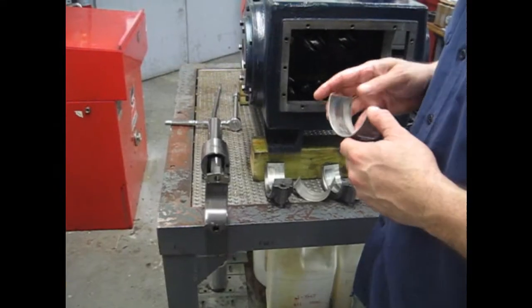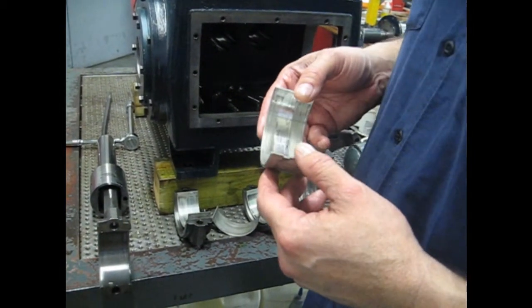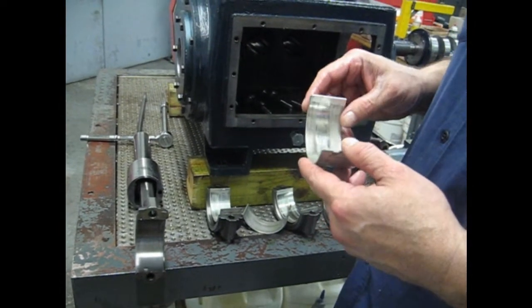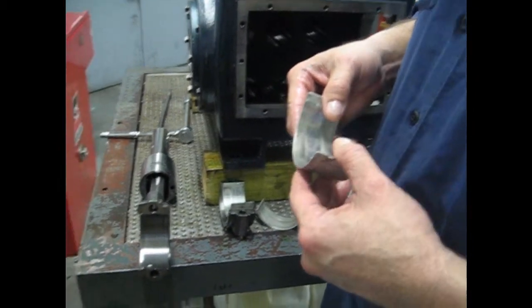After our inspection is done, we go to reassemble. I'm going to go ahead and use these same bearings again, since this is just our lab pump. Again, if you were this far along into your pump and you had some wear in your shell bearings, it'd be a good opportunity to replace them, although these are just fine. This is all normal wear.